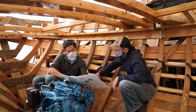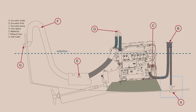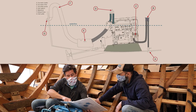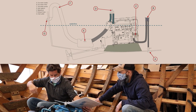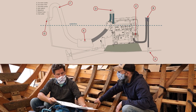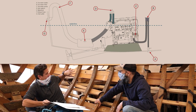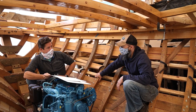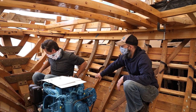For the engine placement, the engine is below the waterline. So this shows your raw water in, up to your raw water filter, and then back down up into the engine — it shows the whole circuit. Then we come out of the engine into a siphon brake, so you'll need a siphon brake above the waterline somewhere aft, which could be mounted to the bulkhead right on the inside of that smaller hatch. And then out to a waterlock muffler — a small inline waterlock muffler that would be aft before going out the back of the boat.